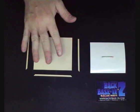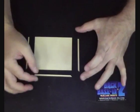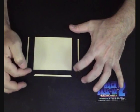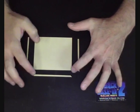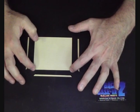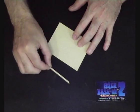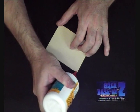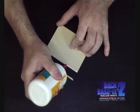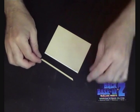To get things started I'm going to focus on the MDF itself, so I'll put aside the MagFlex stuff and the magnets for now. The tray has the base itself, the front lip, and the two sides which have been miter cut to join up on the extreme front corners. I'm going to glue down my front lip on the front of this tray using PVA wood glue, the reason being it gives you ample working time and has a great bond for MDF.